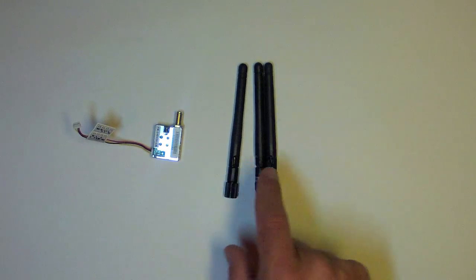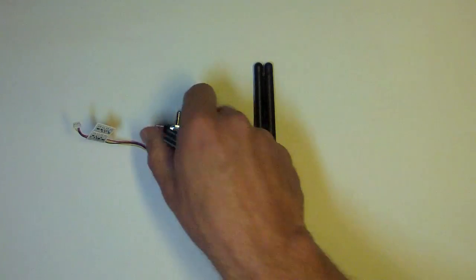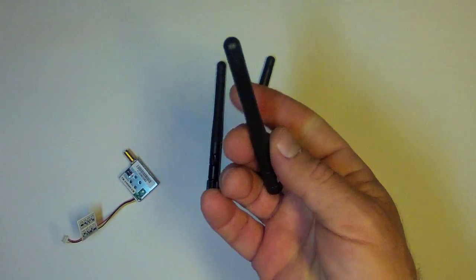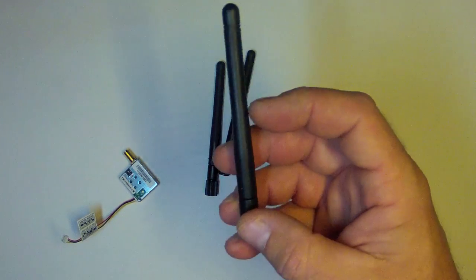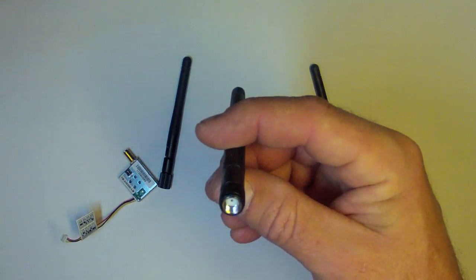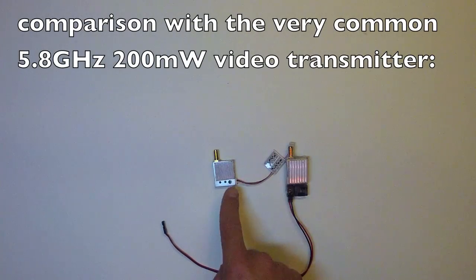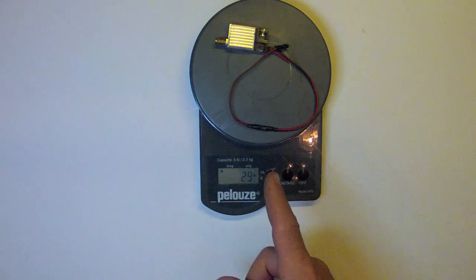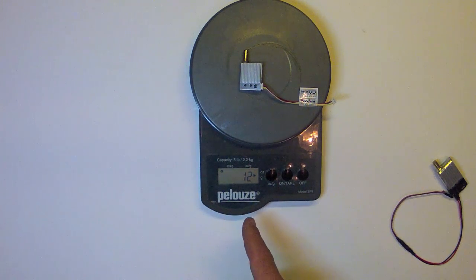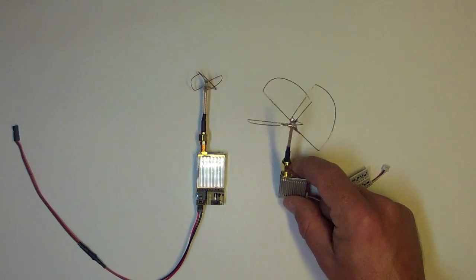You must be very cautious not to mix up your antennas. The LawMate 2.4 gigahertz transmitter uses a standard SMA connector — a male antenna and a female SMA receptacle. These look quite identical to a 5.8 gigahertz antenna, although the actual antenna element inside is much shorter. It also looks very similar to an RP or reverse polarity SMA connector, which does not have the center conductor. The 5.8 gigahertz transmitter with wire is 29 grams and the LawMate 2.4 gigahertz transmitter with wire is 12 grams.